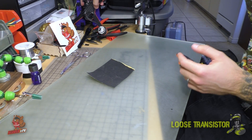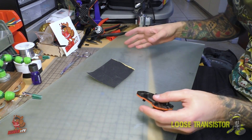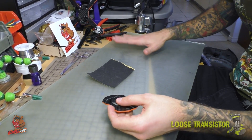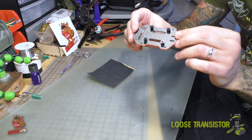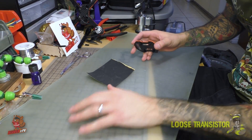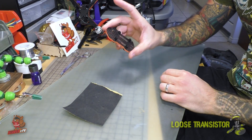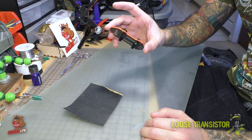I've been thinking about it and some people suggested cutting, hot wire, and all sorts of different things. Then I remembered seeing something about how people sharpen chisels and wood cutting tools — they use a piece of glass because glass is almost perfectly flat. So here's what we're going to do today: shorten these standoffs, which I put on this plate, by about one millimeter. We're going to do that using this glass pane, 400-grit sandpaper, and the bottom plate from the Hive. This is a second bottom plate — I have two Hive frames for spare parts — but I'm going to be using this one right here.